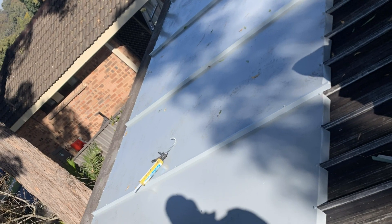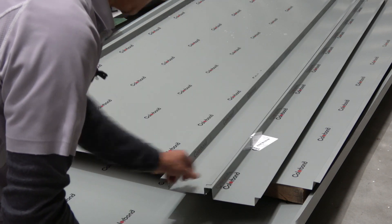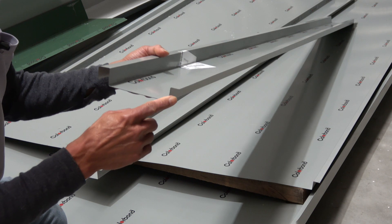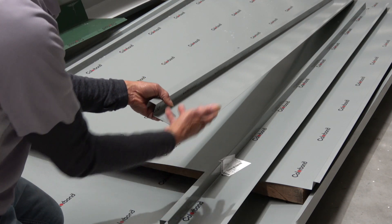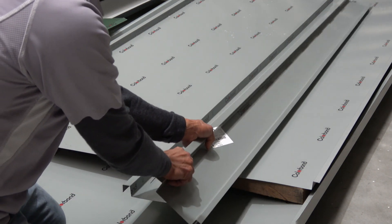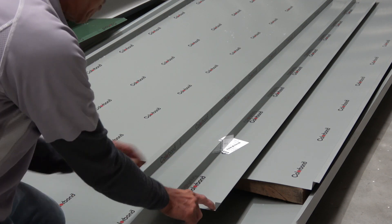The water is contained within that seam, which is quite a wide seam in this instance, and we don't have to put in angles to divert the water because the water is contained within. So how does the standing seam work? It's quite simple. We've got the first one — a fold comes up and a fold comes down — and this second flashing is a repeat of the first one. So they're all virtually the same. This one goes in first and this one just sits right on top of it. With that, you've got two trays, and this can vary in width.